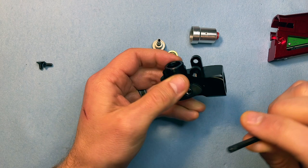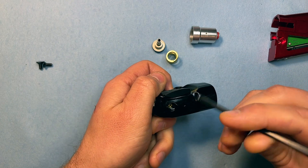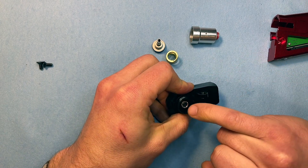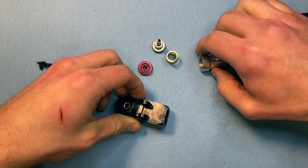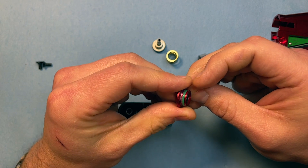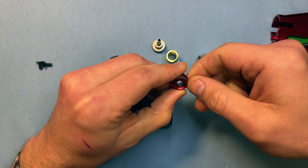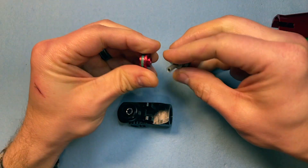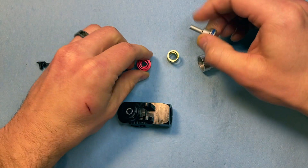There is an O-ring on the inside of this brass piece that could leak, but rarely. If you're seeing a leak coming out of here, that could be one of the culprits. A lot of times when there's a reg issue, it's either this reg seat — because it's got debris on it or gotten damaged — or this little O-ring in here. Dye has made it super handy to get an O-ring pick in here ever so gently and pop that O-ring out to replace it. This is a dynamic O-ring as well, so it gets friction from the reg piston as it goes back and forth.